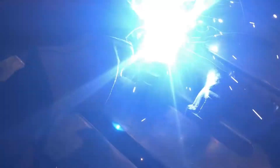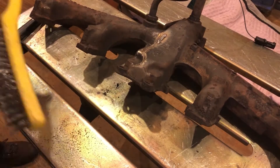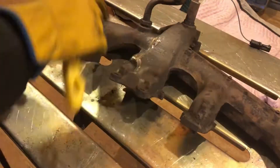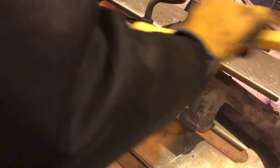Now that we're at about 500 degrees, I decided to start welding. I weld about an inch and then do some peening on it to relax the metal, which also clears off some of the slag. Then I clear the residue off with a wire brush and just repeat this process all the way down the weld.